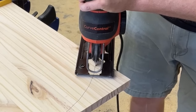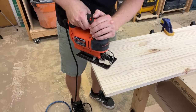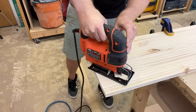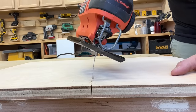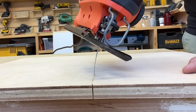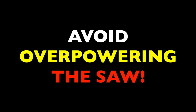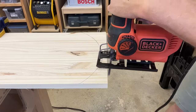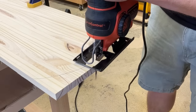The third reason for jigsaw blade bending is a very common problem, especially for newcomers: sideways pressure. This happens most frequently on curved cuts, which is primarily what we use jigsaws for. Ideally when you're cutting curves, you negotiate the turn slowly, little by little. But if the saw is having a hard time turning and you fight it, you can wind up dragging the saw sideways, or twisting the saw too aggressively to force the turn. This leads directly to blade bending and wandering. With curved cuts, you need to avoid overpowering the saw — you can't muscle it through the board, you have to let it cut its way through. Make tiny backward pulls to reset the saw path frequently, and consider making relief cuts to shorten curved sections, which will relieve blade pressure and help the blade remain vertical.